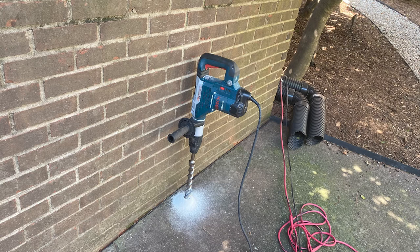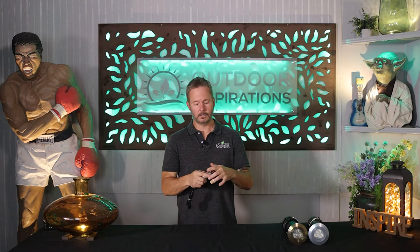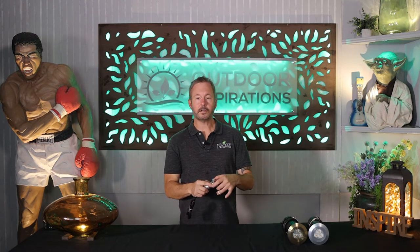Be very precise on where you're placing, because once you do that, it is what it is. Sometimes technicians will hook up the wire before running it through the paver, and then they can't run the light up and down due to the top shield. When you get in trouble like that, if you ran your wire ahead of time, no big deal — the top cap comes right off. That way you can run the wire through your paver, then put the shroud back on top. That cap gives you flange protection that covers your core drill hole, which is oversized beyond that inch and a quarter, giving you seamless, professional coverage.